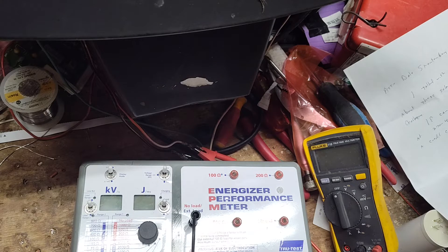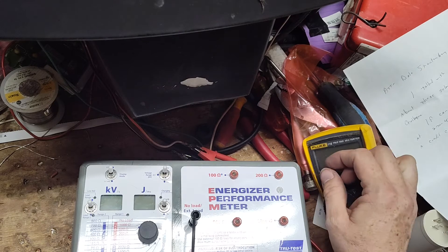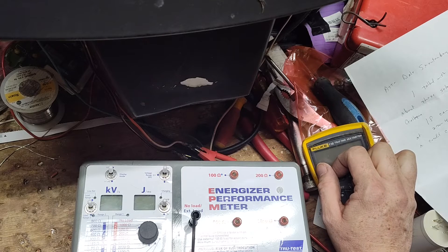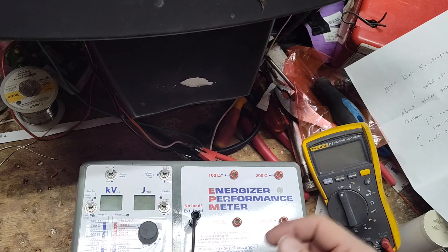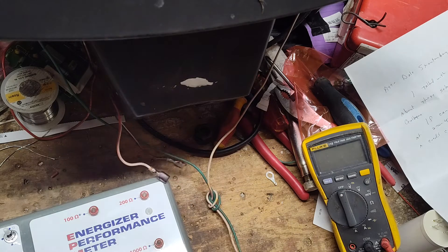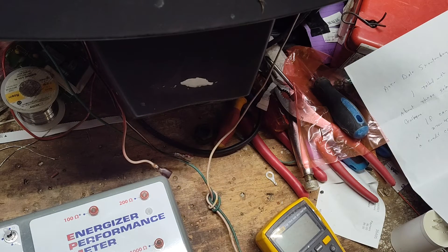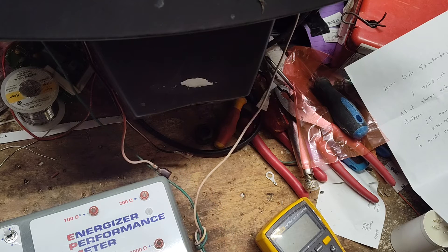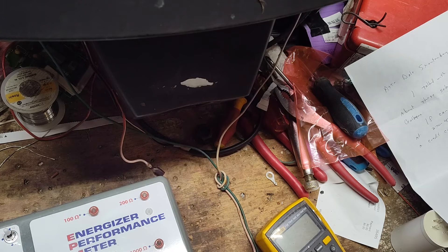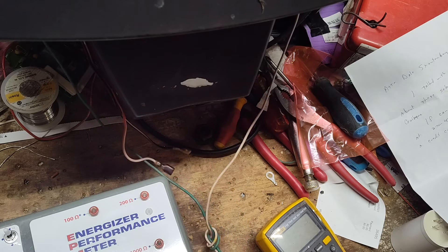I think the circuit board is fine. I'll take it outside and check the panel in direct sunlight — it's kind of a halfway cloudy day, so we may not get the best reading, but we can use good judgment on the light level versus the voltage at the battery wire leads. This thing might just need a new battery and that might be it — we might luck out with a $30 battery. He also needs a new clamp on there, which we probably have in stock — that's like a $2 or $3 part. So he probably escaped this one pretty cheap.